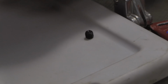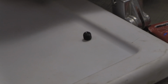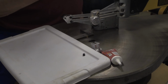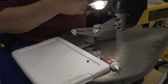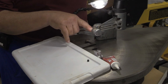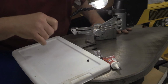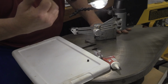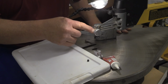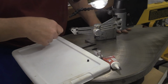Smoke's also bad. Case in point is the part that I just went through there where you're tightening this blade clamp down, if you pull the blade out and the thing's bent, then it's time to start figuring out why. Which direction is it bent? If it's side to side, it could be the set screw is either through too far or not far enough. If it's bent front to rear, chances are it's because that anvil that goes through that blade clamp is frozen. So it's a fairly easy thing to do.